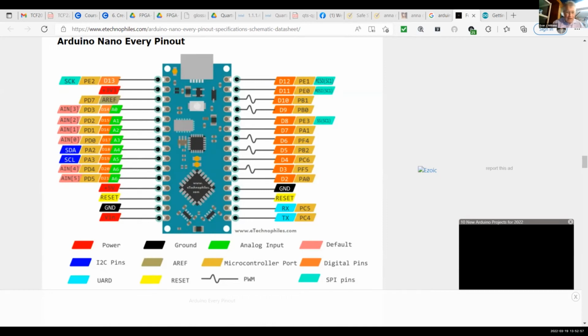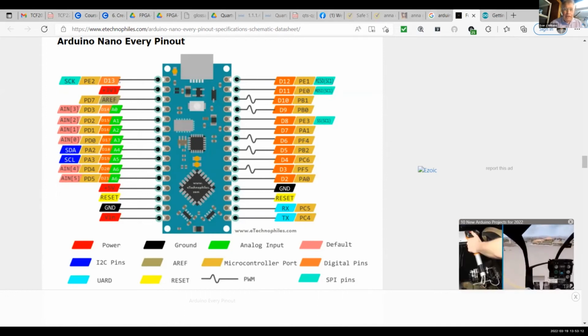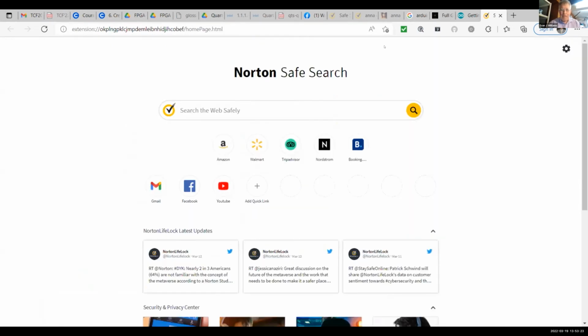It's object-oriented programming. I'd like to touch on that briefly. I have some time. Let's finish our little blink example, and then I'll try to go further in helping to engineer this project. So what is LED built-in? If I am blinking an onboard light, which one of these pins corresponds to the onboard light that's blinking? I think it's pin 13. We can either guess or we can look it up. It's better not to guess if you can help it.